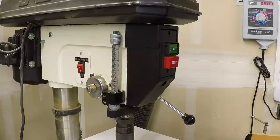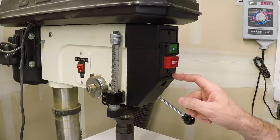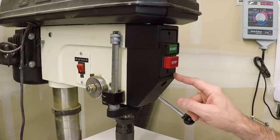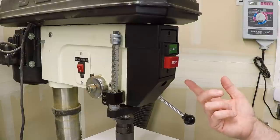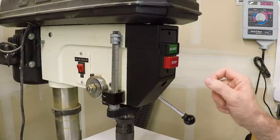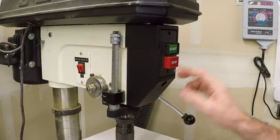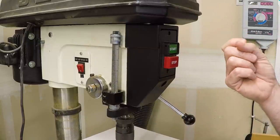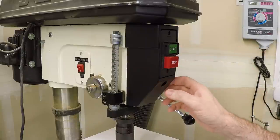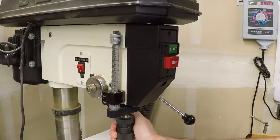It is a good solid drill press, and since I'm doing a spindle upgrade on my CNC mill and deleting the quill in that process, I'd like to get this drill press working for general drilling and tapping operations. So we're going to put a three-phase motor and a VFD into this, maybe mess around with the belt drives and replace them with something that gives me lower gears.